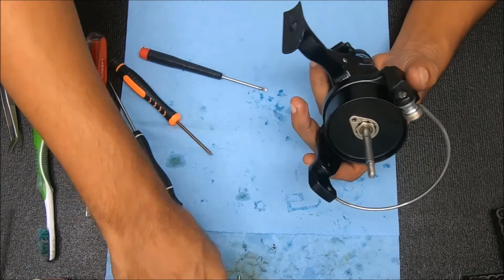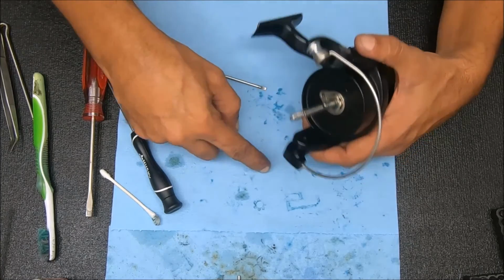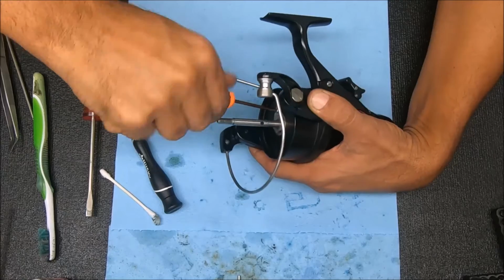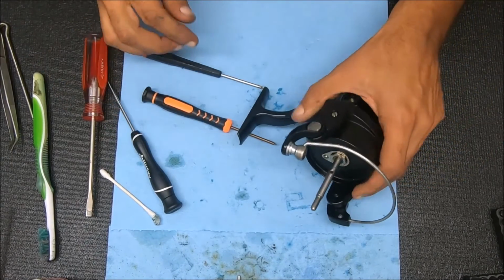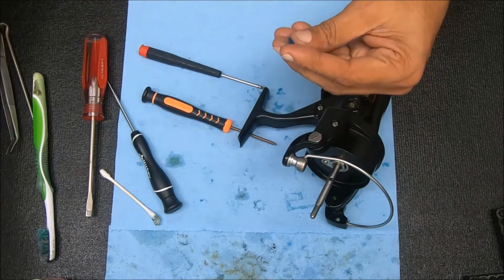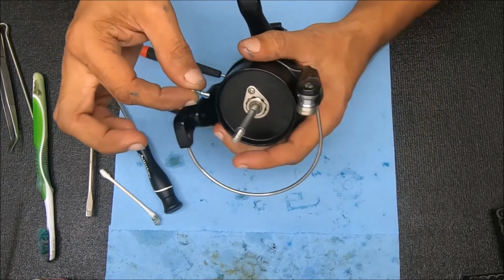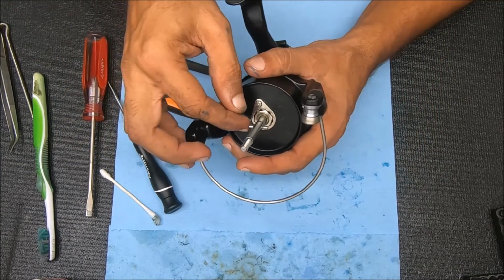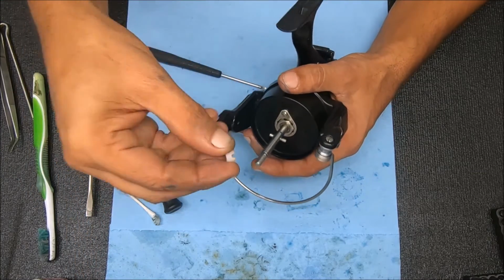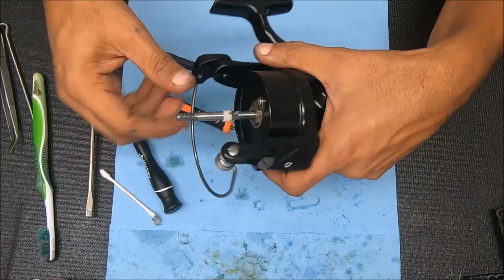Alright. Put our set screw in. Get everything assembled and test it out. A little bit of grease there, so it doesn't get frozen inside. Remember, it only goes in one way, so if it doesn't go in the first way that you try it, try the other way. Stick our collar on there. That collar has a little slot on it that goes over one of those posts, kind of like that.